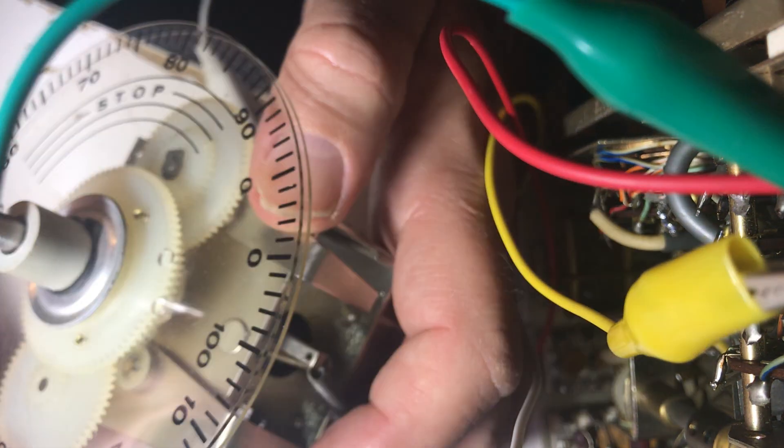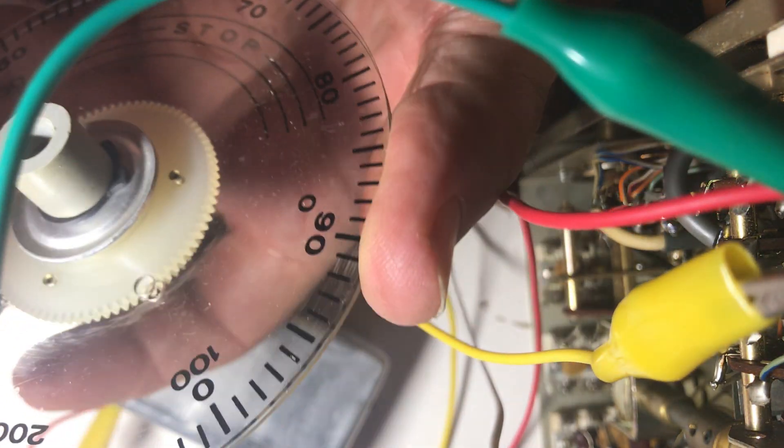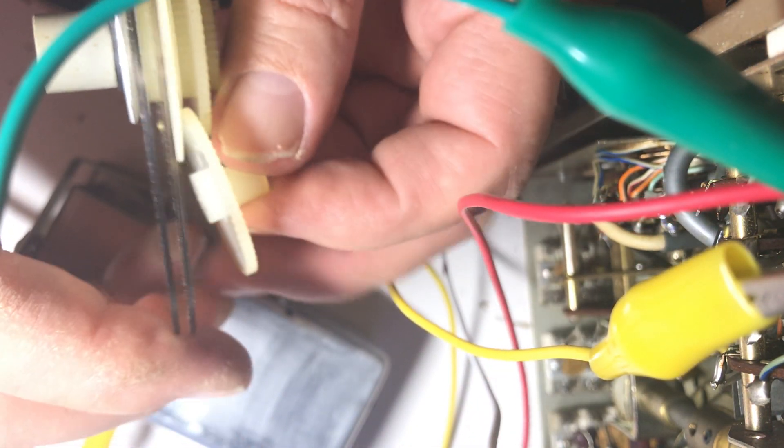You can't move these wheels unless this gear's out - you can't move them independently unless that's out. So I'm just going to take this back out. Once they uncouple you can move them around again. Let's get these things lined up - go back like that and put it back together. We put the gear in here like this, put it back together with your finger, hold it straight up, don't mess around with the worm gear, and slide it back on.